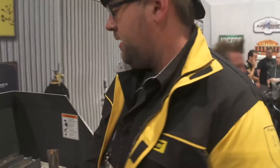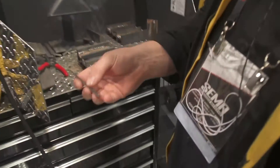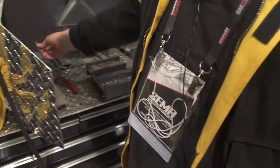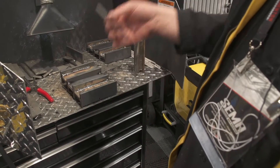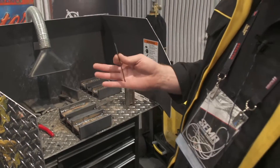The other reason we drag is that while we're welding, there's a slag system. Flux core wires have flux inside them that will form as slag as the weld cools. This helps protect the weld during cooling and also helps hold the weld in position as it cools. For this all-position flux core wire, we have a nice tight slag system, so when we're going out of position, it builds a shelf for the puddle to hang in.